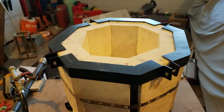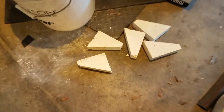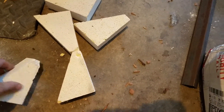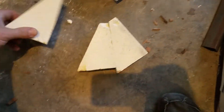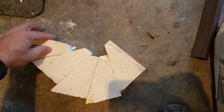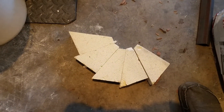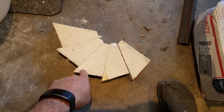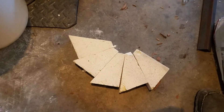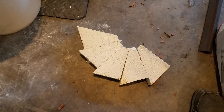The lid is a series of these smaller bricks, oriented in a pattern. You orient them like that, keep going, and you'll end up with a circle, and then you can clip these off. There are 10 or 12 of those that actually make a lid. They are the 4.5 inch by 4.5 inch square bricks, just cut at a 30-degree angle, put in a circle and mortared together.